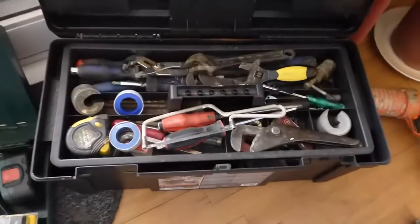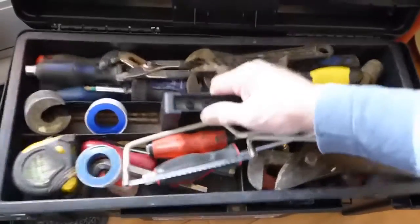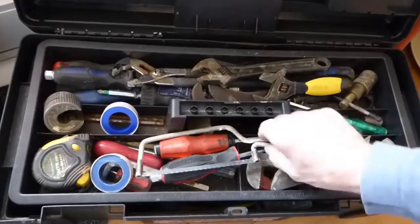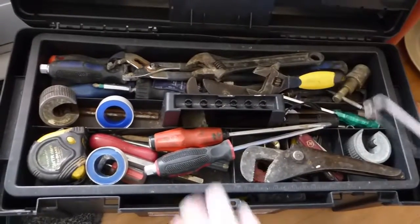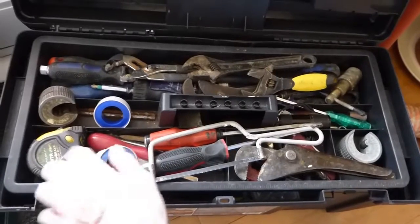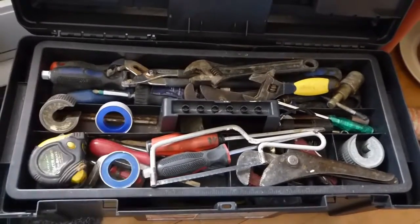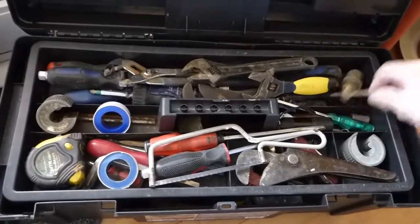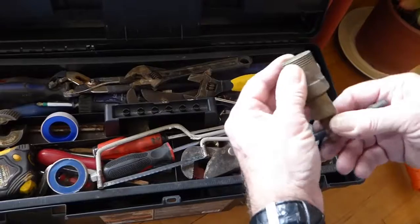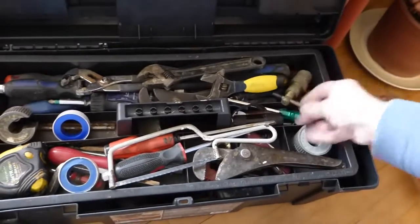So that's that. I'll just show you generally the main kit now, inside the box. There's a tray here — this is my main tray. As you can see, it's got invaluable items like a junior hacksaw, sets of screwdrivers with posi ends and ordinary ends, PTFE tape, measure, pipe cutter, just general gear. This is an actual olive puller — very useful, pulls olives off of pipes when they're jammed on.